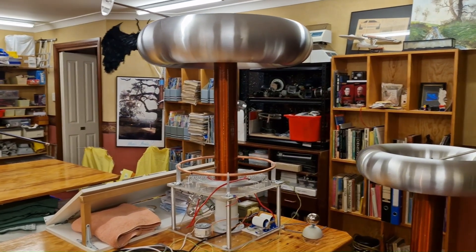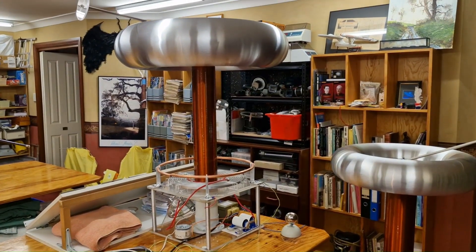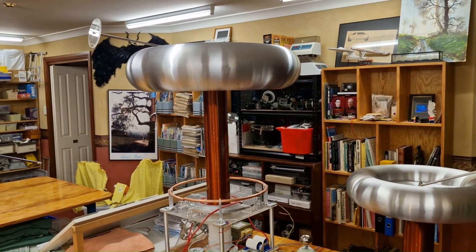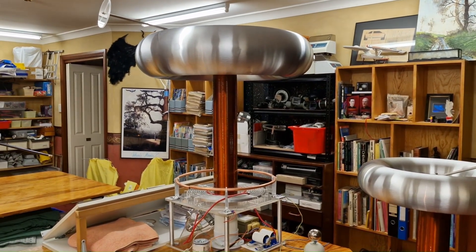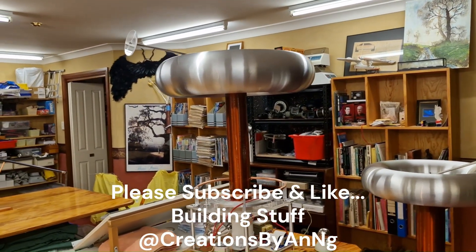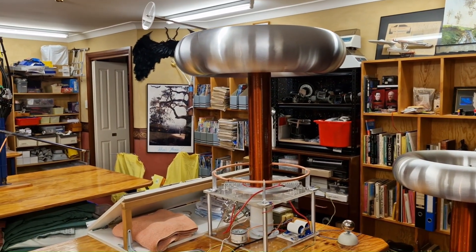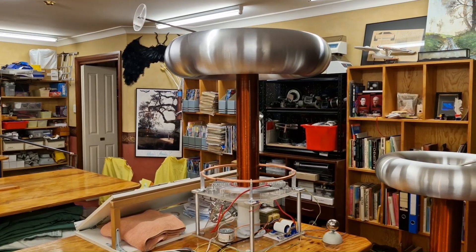That's the single microwave oven transformer Tesla coil. Quite an impressive performance considering it's only one microwave oven transformer - easy to wire, not too complex in the primary high voltage circuitry. The toroid I've used is a little bit oversized - that's the one I had - but almost certainly you could use a smaller toroid and tune it appropriately, and it will probably perform reasonably well. So if you enjoyed the video, please like and subscribe. In the next video, I'm going to look at possibly one of a number of things - the lessons from the secondary coil graveyard and whether size matters in the secondary coil. See you all next time.